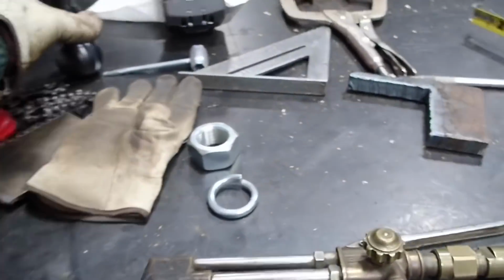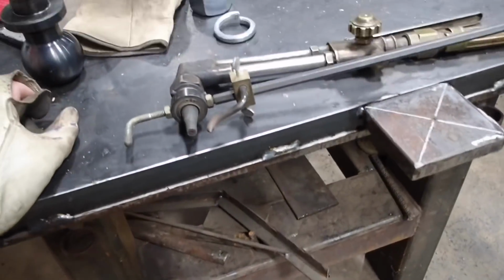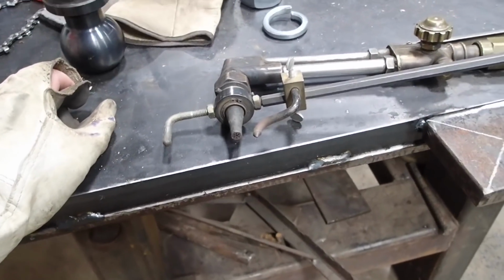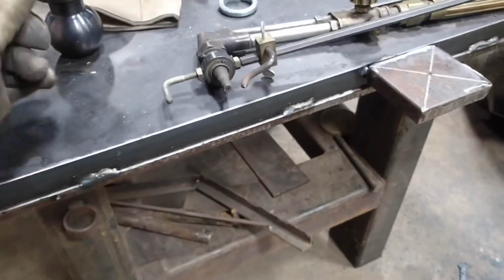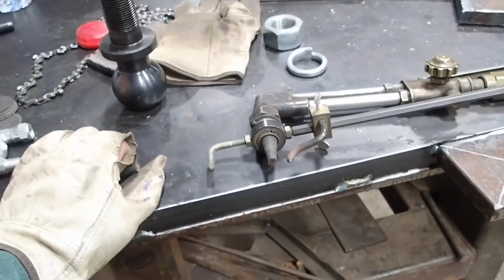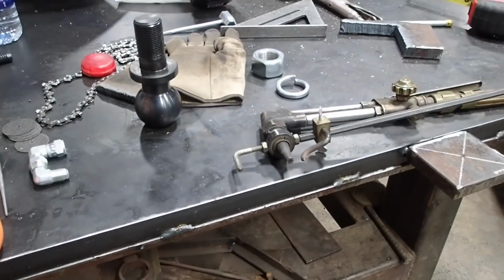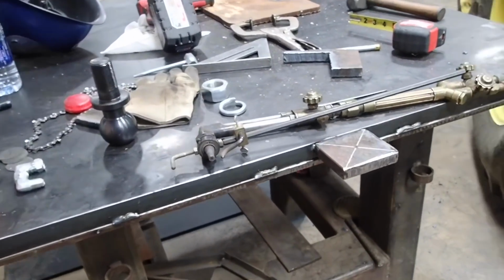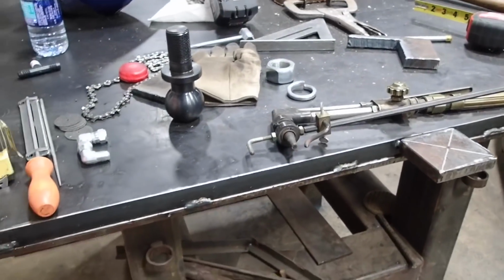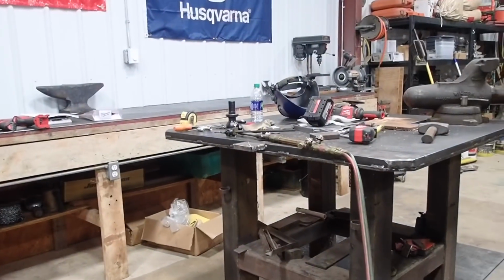Now, this is an inch and a quarter shank. So you're going to go half of it, which if you figure half of an inch and a quarter, that's going to be 5/8. And you can figure that pretty easy. If you can't figure fractions, just punch in 1.250 and divide that by 2, and that'll give you .625. And the fraction conversion of that is 5/8. If you don't know what that is, then you can just take 5 and divide 8 into it, and of course it'll give you .625. But most all your main stuff, anybody who's fooled with it a good bit will know.